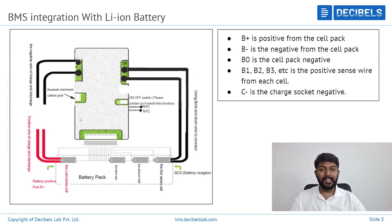In order to handle the current capacity, rather than using a very thick single wire at one end, I would prefer to use two wires of half the size so that the current is split. For example, if 60 amps requires a thick wire, using two 30-amp wires will reduce the overall cost and also give the flexibility to bend and connect the wires more easily.